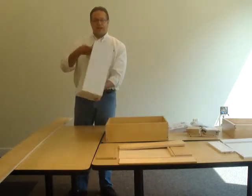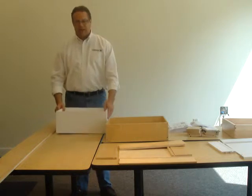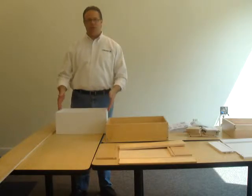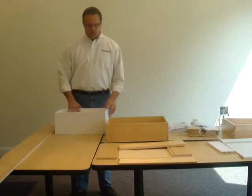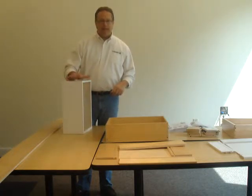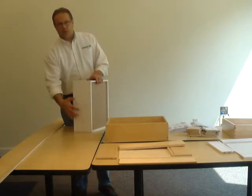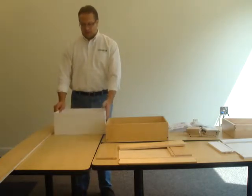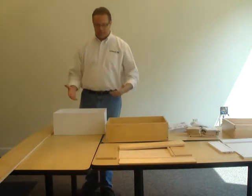The drawer that you see here is actually a closet drawer. So this is 13 3/4 inches deep. Because the closets have a pretty standard size to them, these drawers are available in 18, 24, and 30-inch widths by 13 3/4 inches deep. You specify what you need in width, and the minimum order on the closet program with BHK is 50 pieces. The drawer front will come pre-drilled, so when you put your drawer front on there, you just screw it in from the back and it's already done. So again, that is a nice program if you're doing closet. Quick assembly, ease of installation.